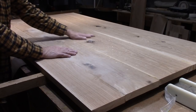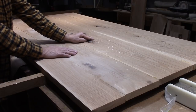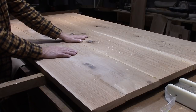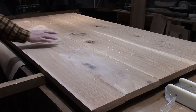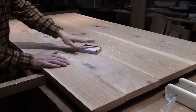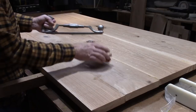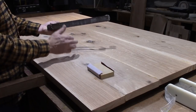But one thing I wanted to point out was, once you fill them with the epoxy, some of them were sticking up pretty good, and I've come over with a router and kind of knocked the tops off. But there's lots of ways of flattening them out. You can use sandpaper on a block. One of the fastest, though, is this, an old tool of my grandfather's. It's used for flattening body filler